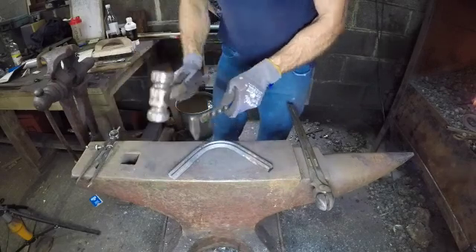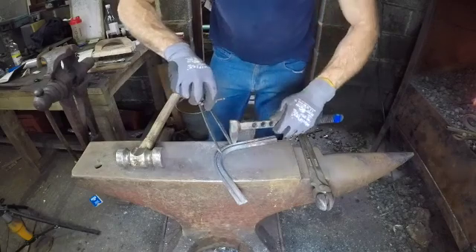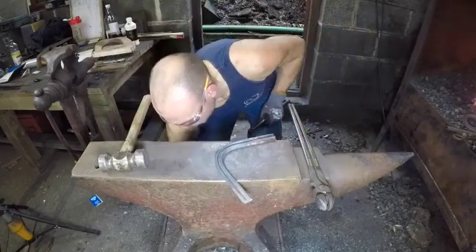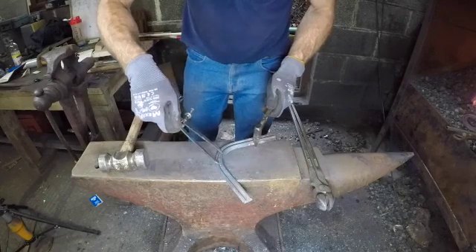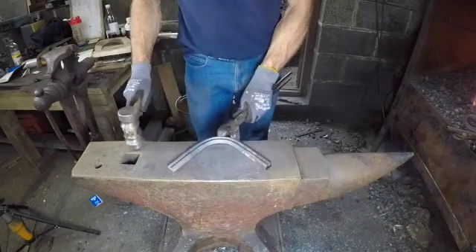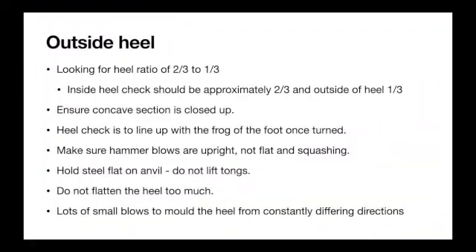The callipers have been marked using the inch and an eighth rule. I check from the centre mark to the outside and lean my stamp up against the edge of the calliper. Once you've made the two toe nail marks, just double check because if they're out they really catch your eye. These toe marks along with the centre mark form a great reference point that you can balance on the edge of the anvil to assess for balance.